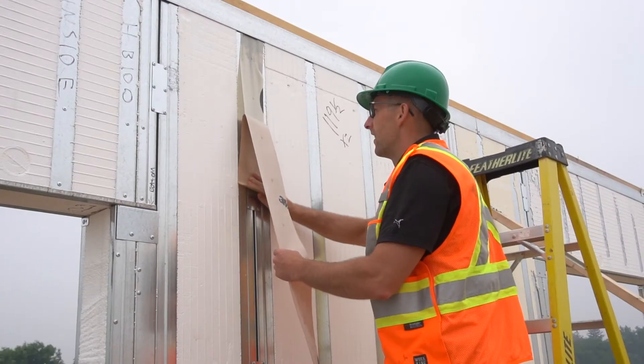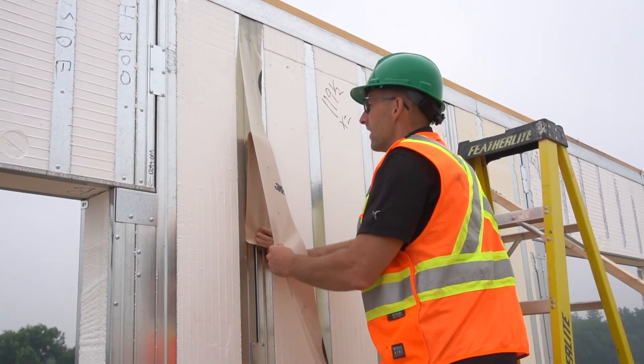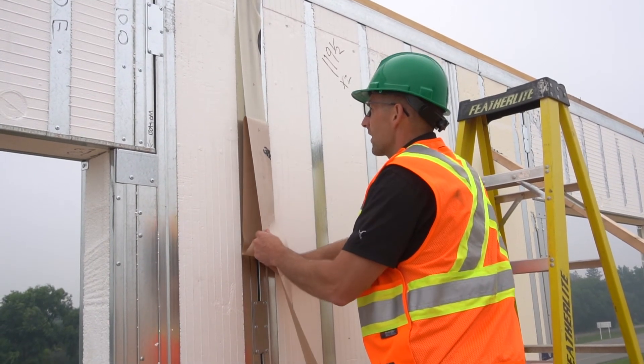At the outside of the ice panel assembly we seal the corners, header panels and sill panels, and anywhere there's a butt joint or no shiplap on the outside face of the ice panel. Once these steps are complete, your wall assembly is vapour tight.